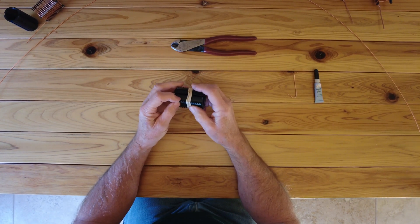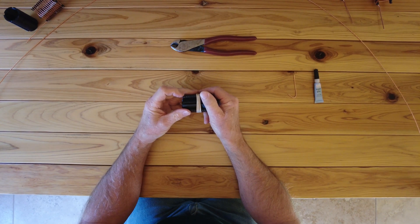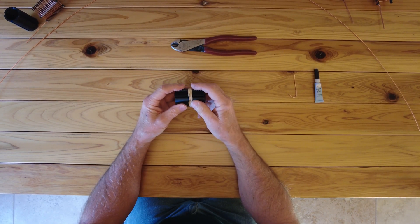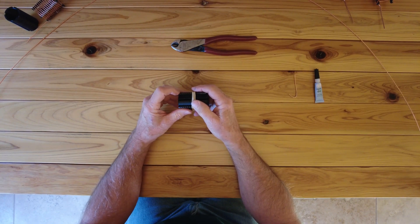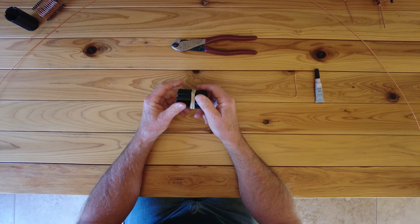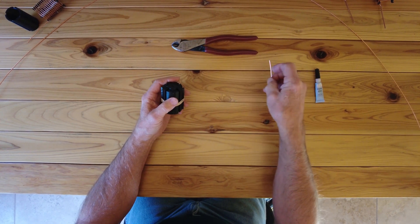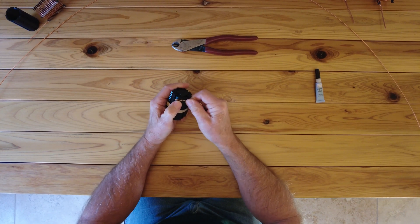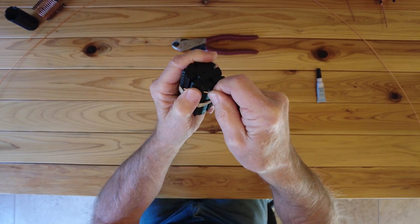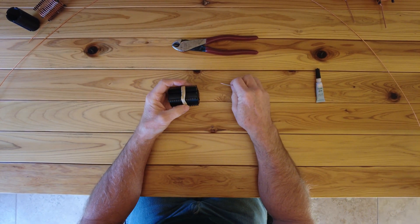The grooves — these slots in the strips — are circular at the bottom to hold the wire. When you work up the design, you specify the wire gauge you want to use. That will set the channel width and the diameter of the cylindrical slot at the bottom. I put a little bit of extra material in the design so that the wire, when it goes in, should actually kind of snap into place. And that snap fit tolerance is also a variable in the model design.